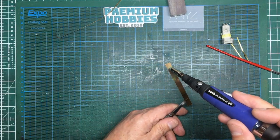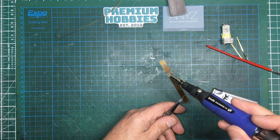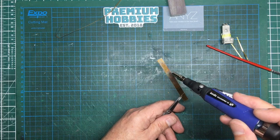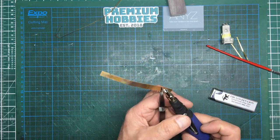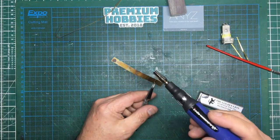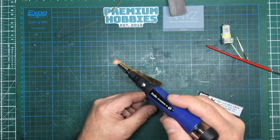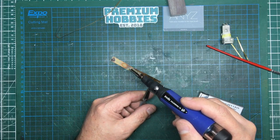I'm not putting that much heat in purposely because it will happen in seconds. If it glows red, get the heat away as quick as you can — it's about to melt and will end up being a blob. You can see it's turning this blue colour and then going back to a straw colour. I have heard people say you can use soap to monitor the colour change, but I've never tried that. You can see the blue hue remaining behind the flame — that's what you're looking for.